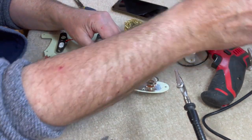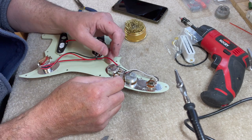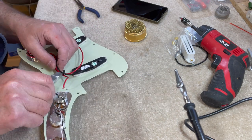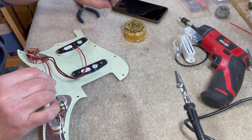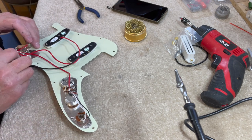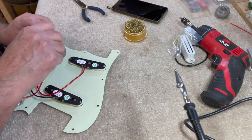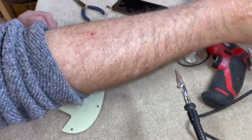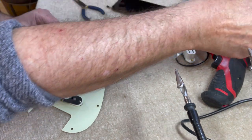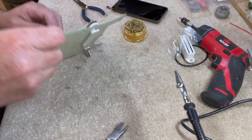Okay, so for a minute I'm not going to replace it. I'm just going to let this thing get hot. The reason is it's going to sit there, and I want to get to the top here. So let us undo this small amount of cable tying, and we'll take out the bridge pickup. The bridge pickup goes earth there, and in this case it's the white lead to here. It's going to go to the same place on the switch, but we're going to have to cut this, because I don't think we're ever going to get that disentangled. So there's our bridge pickup being removed.